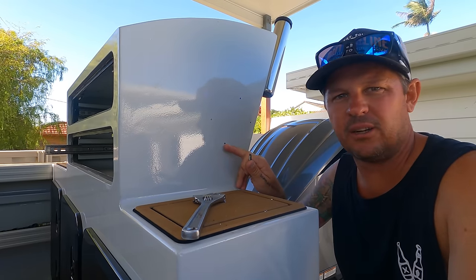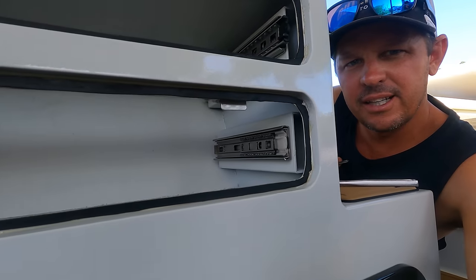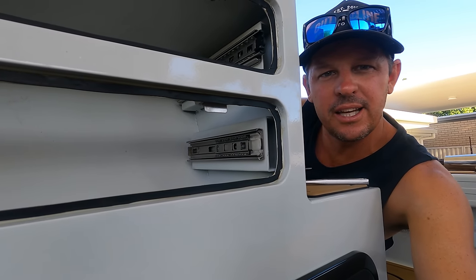So this first hole that I've done here, I just had to use a little M6 tap and die kit, because if you come around on the inside, you can see there's some box section there, and I can't get a bolt on that. So I'm going to put that through. I'm going to Tef-Gel it. I might even be real fussy and heat shrink the bolt and then Tef-Gel it,